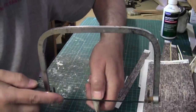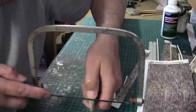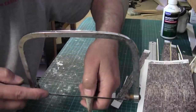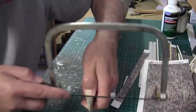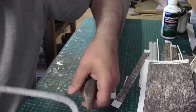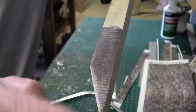I'm just using a coping saw, but if you've got a razor saw you could use that. I'm using a coping saw because I get a thicker line. I'm just going across all the lines I've marked with a pencil. It seems to be working - it's not furring up. I was expecting the MDF to fur up, especially with little score marks like this, and it seems to be working. Now if I didn't put the super glue in I reckon that would have just furred up and looked messy.